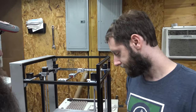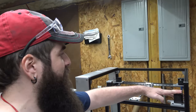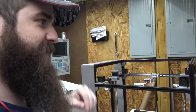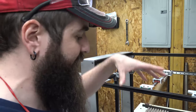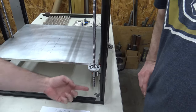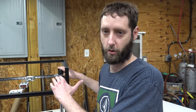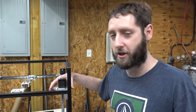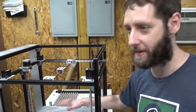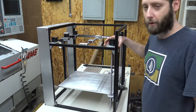Something a handful of people aren't overly fond of: we're going with all three independent motors for the Z-axis. Right now we have those on the top because we didn't think some of that stuff all the way through for this prototype until halfway through. So on the next one the Z-axis motors aren't going to be up here on top — they're going to be down on the bottom. That was totally my fault. I thought the Z-axis motors looked really cool on top, but after we machined all the parts and built it, it dawned on me.